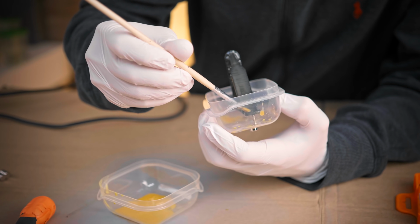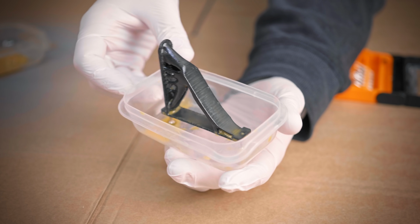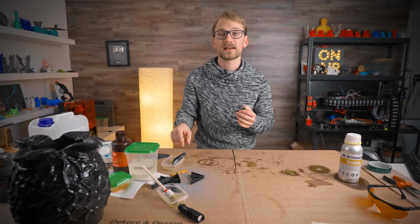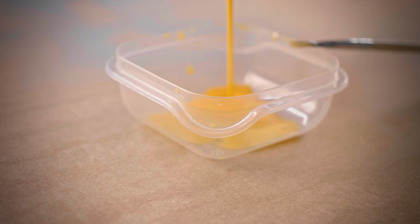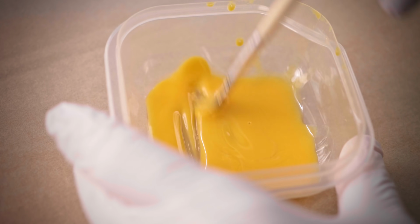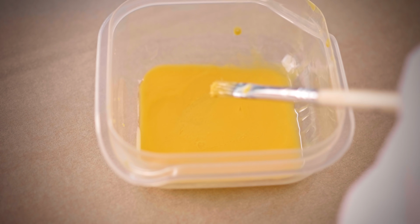So open surfaces like these had most of the resin running off, but on the inside corners it still accumulated quite a lot. When I went to clean up the first part, I accidentally dripped some of the isopropanol into my resin container, and that gave me the idea to actually thin down the resin before applying it. With just a thin layer of diluted resin, the solvent should evaporate off fairly quickly, and if not, I can always help it along with the drying feature of the CW1 or some warm air. But the extra runniness at the start should be enough, that's this part, to get it out of inside corners quickly.